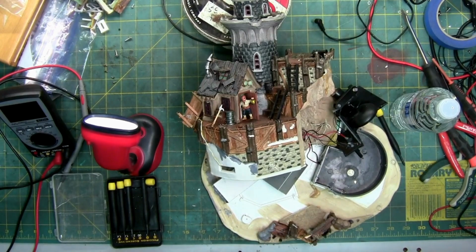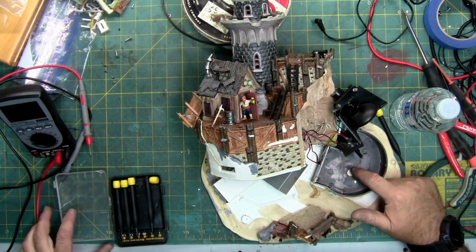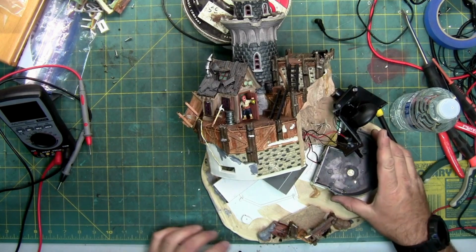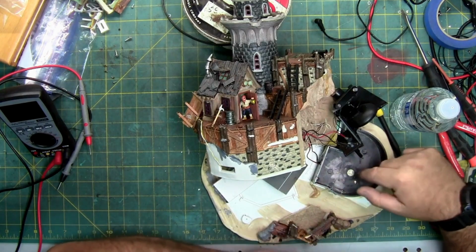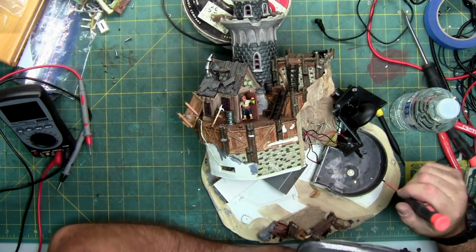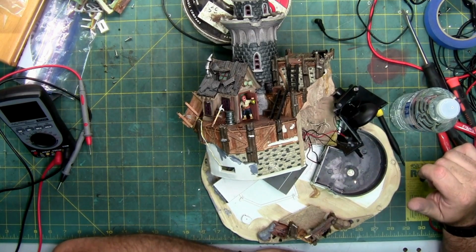All right. I got the screws out. There's 5. So there's 4 here, and there's 1 over here in the corner. The disc is corroded. It's green. That might be why the fogger is not working. To get to the fogger disc, you'd have to remove this from the base, which is hard glued down. But we're going to test it. I scrape some of the corrosion off with a screwdriver. Try and scrape some more. The two probes that send the signal for the water, they're clean. Surprisingly, I thought they'd be corroded too, but they're clean.